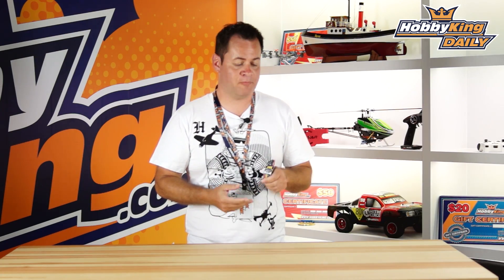And we're finally able to release it to the public. The hardware on this was actually designed for 12S, but as a margin of error, we rated it between 3 and 8 cells. A lot of people out there might not realize — why would I even want an 8S setup or a 6-cell setup on my multi-rotor? And the key word is efficiency. Higher voltage equals efficiency, if done properly, as well as other benefits. The higher the voltage, the lower the amperage for the same amount of resistance — if you're familiar with Ohm's Law or Watts being put out.